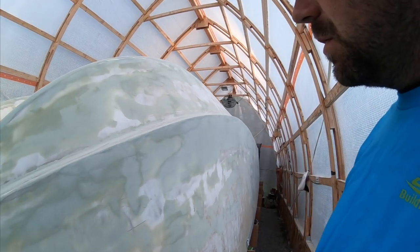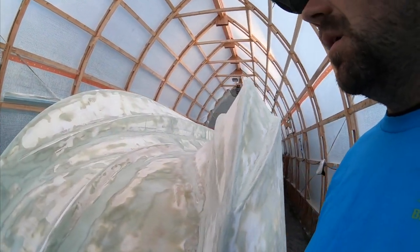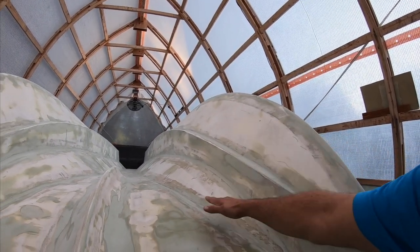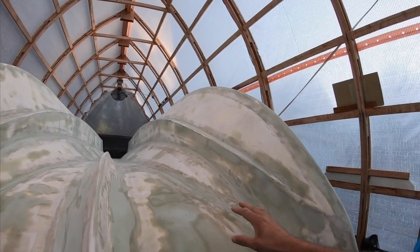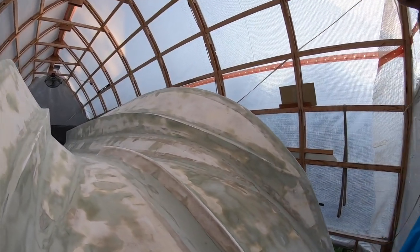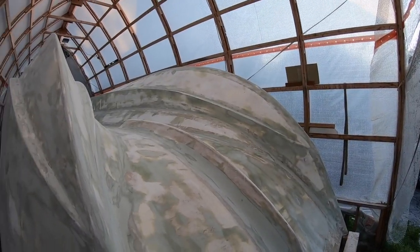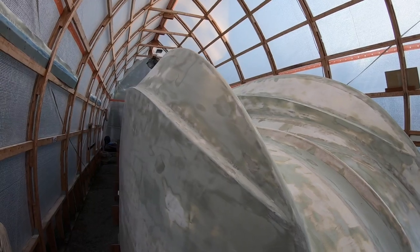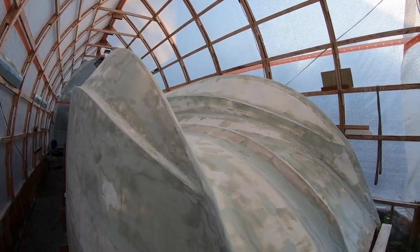And it calls for 3 coats total, we're gonna do. And then after that, we have to sand the tunnel back to 320 grit. So when I say the tunnel, I mean basically from the water line on this panel here, down and up the other side to the same point. Everything that's above the water line that is primed will get a coat of, we're gonna use Epifanes white paint, and I believe it calls for 1 coat and maybe 2. I have to read a little bit more into that one still, but so yeah, that's the plan. One more round of sanding with 320 after the primer goes down, and we should be pretty much good to go. Hey, we're finally off of sanding videos, so can't complain, right?